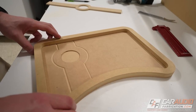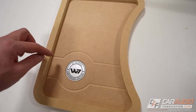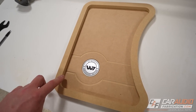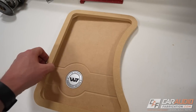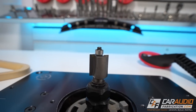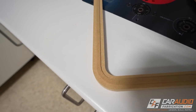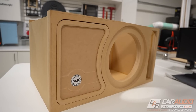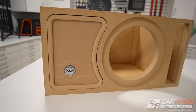As we assemble this, you really start to get more of a feel for what the finished product is going to look like. I love these added lines — that's a nice subtle detail to go around the logo. I want to soften up this hard corner, so I'm going to use a roundover bit on the inside radius and also prepare this for being wrapped with upholstery materials. On the back side I'm going to be cutting a rabbeted groove, which will allow clearance for the vinyl to wrap around to the back side. I wanted to give you guys a rough idea how this is going to look, so I template taped these into position.